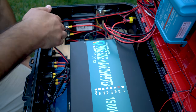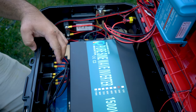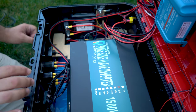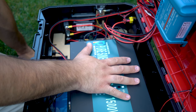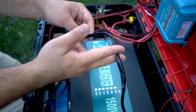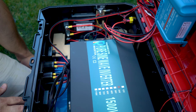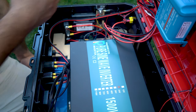Over here is my 12V rail, tied in up here to my 12V regulator. It comes in and plugs into all my different utilities using spade connectors that I crimped on — one line jumps between the four different outlets to power them. Now the 12V is not actually powering the USB ports on the side. Those are desk-mount USB units that are actually powered by two AC plugs soldered and shortened from the inverter. So the inverter is powering those USB ports — meaning if I'm charging USB, I try to use the front DC-powered ports first because there's a little inefficiency in going DC to AC and back to DC.